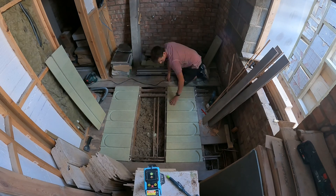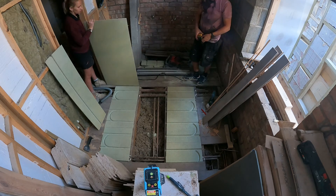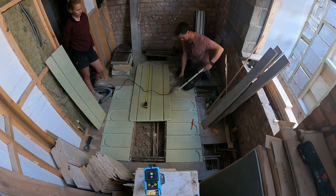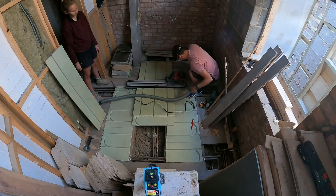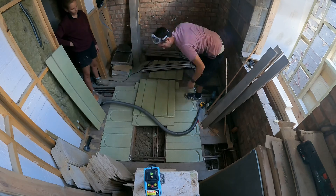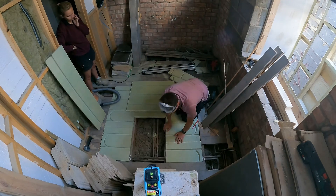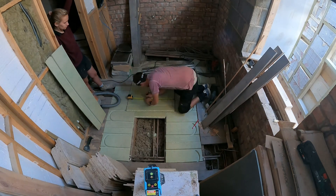You see me here shooting the laser over the floor, which enables me to follow the joist, choose the cuts on the boards, make sure they're all straight and in sync, and gives them appropriate cover sat on a joist. I then go ahead and fill in all the gaps between the two return boards. As I said, the straight boards only have three grooves. I'll mark it out, measure it all, and just cut the boards to fill in the gaps.